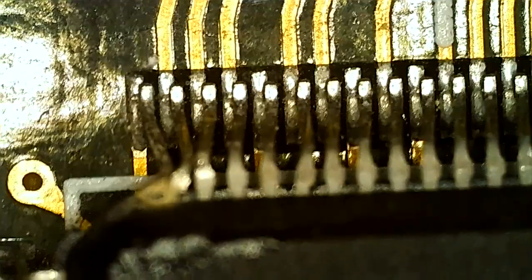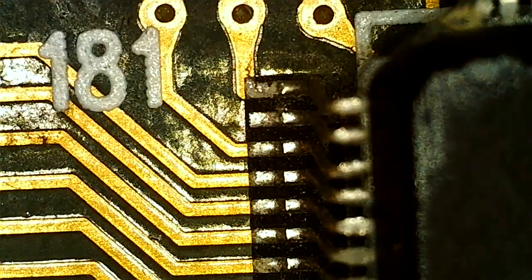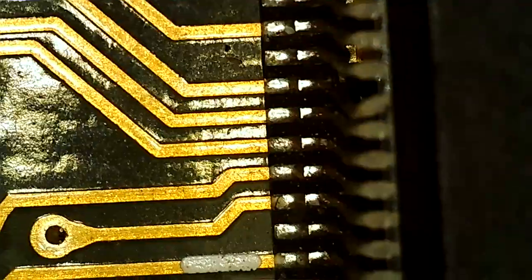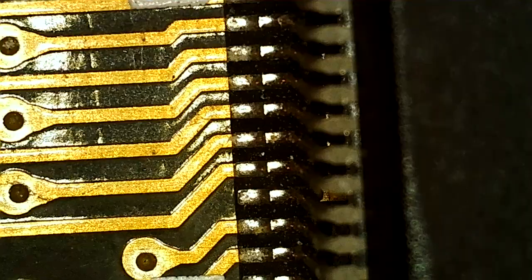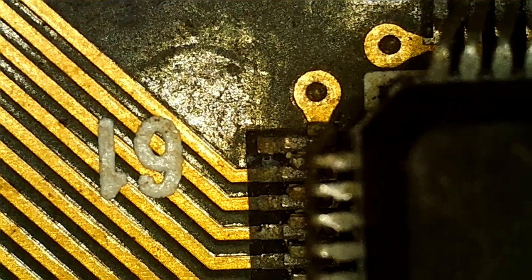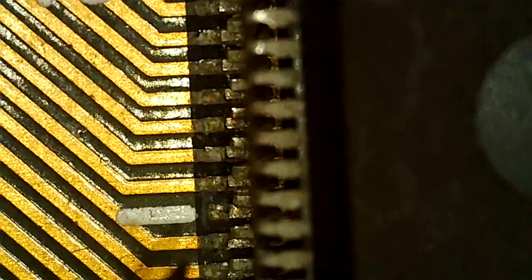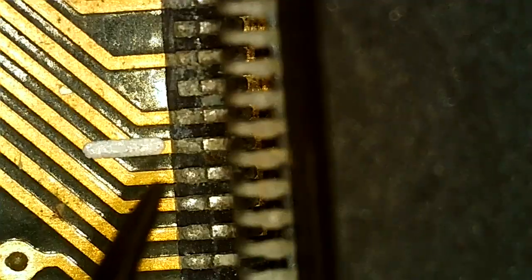This is a common problem, even if you haven't physically damaged it, for pins to get loose over time. This looks like they could be in place, but it could be a visual illusion too. It's not, that's loose too. Loose, yeah, so those are cracked, and that's kind of common on a Voodoo 1 and Voodoo 2s. I have to turn the PCB around now. Yeah, it's just impressive this chip hasn't fallen off. Are there any pins that aren't loose?